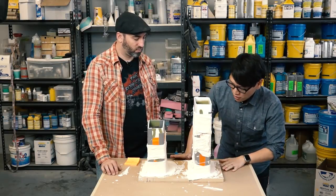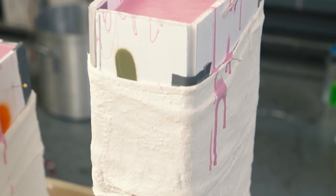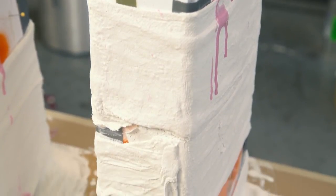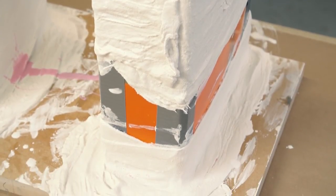So these are the two mold boxes — the molds aren't there yet, the molds are made of silicone rubber. What type of silicone rubber are you using? I'm just going to use Mold Max 30 — it's a tin-based general-use rubber. We don't need anything fancy for this: doesn't need to be platinum, doesn't need to be high or low viscosity, doesn't need to be clear. Mold Max 30 is fine.